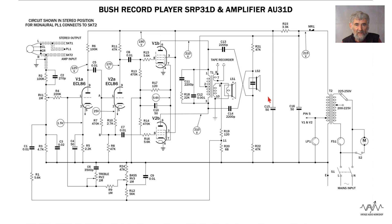The power supply is fairly typical of the time — you've got two fairly big capacitors of 50 microfarads. The anodes are driven directly off the reservoir capacitor; the screen grids and the rest of the circuit are driven off the decoupled circuit. A little unusually, there is no further decoupling for the input valves — there usually is a resistor and another capacitor there to keep the hum down. Presumably this didn't hum badly the way they did it, and therefore they saved the expense.